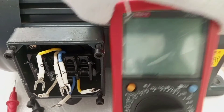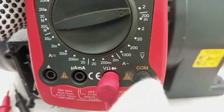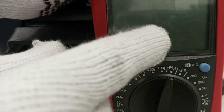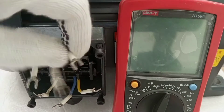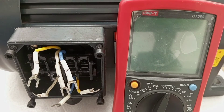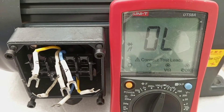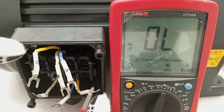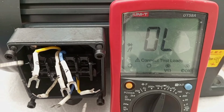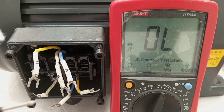In this video, I am going to use a multimeter to do the continuity test. The continuity test means that the beginning and the end of each winding should be continuous without any break. I have set the meter so that if there is continuity between the start and finish of the winding, the meter will sound — meaning there is no break in that particular winding. Or it should read very low resistance, which is 00.